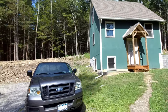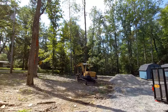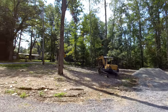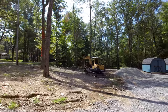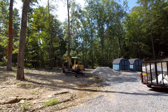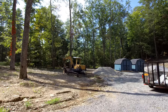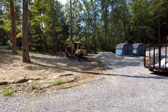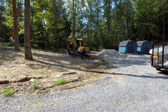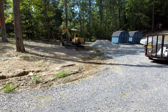So there's a good chance I'm probably going to be digging across it. But I'm mostly digging in the fill I brought in, and that electric service should be at least 18 inches down, so there shouldn't be any chance of seeing that. But I just got to be careful and watch that I know it is there, and not pull hard on any things that may seem like a root. You just kind of dig slower and take a little less off, because you don't want to dig up a buried utility like that. That could turn into a headache. All right, so let me get started here.